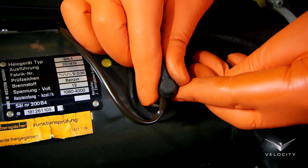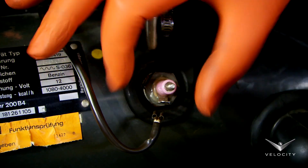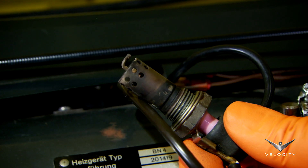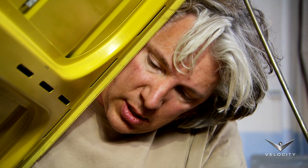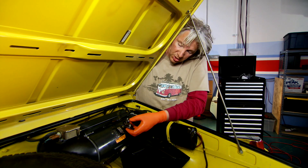The petrol in the system is vaporised and ignited by a special heated spark plug, and I check to see first if there's actually a spark. Look at that — lovely fat spark. That's working a treat. We also noticed there's no sign of any fuel actually on the plug — it's not wet in any way at all. I think probably the problem is something to do with our fuel supply.